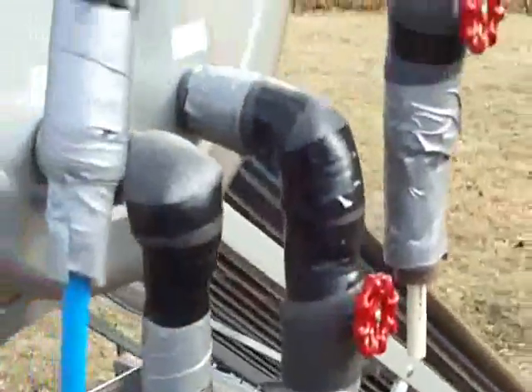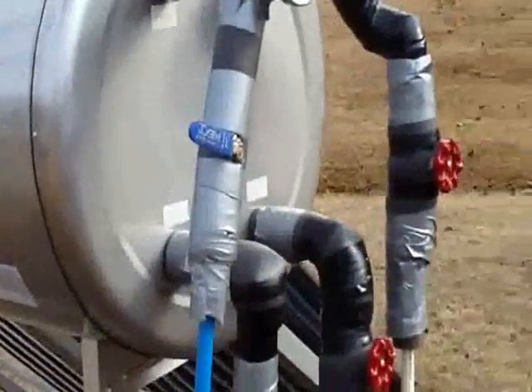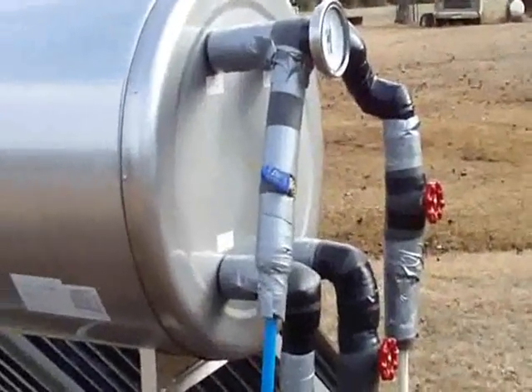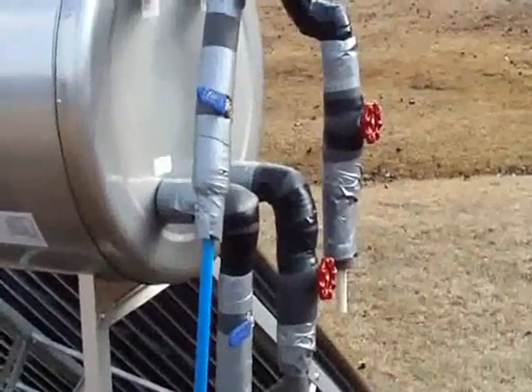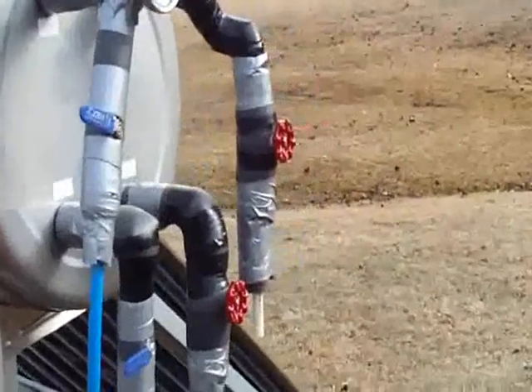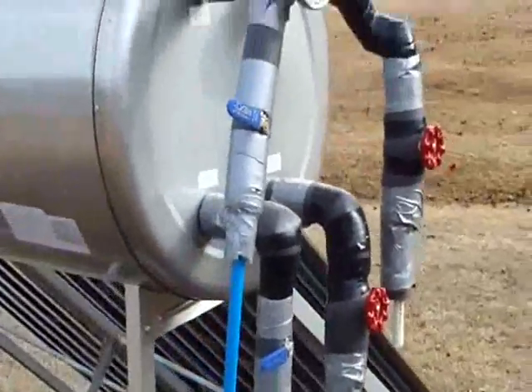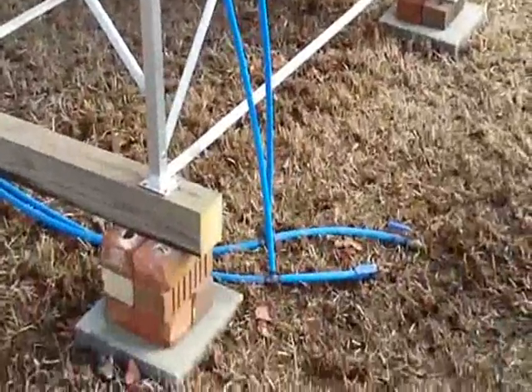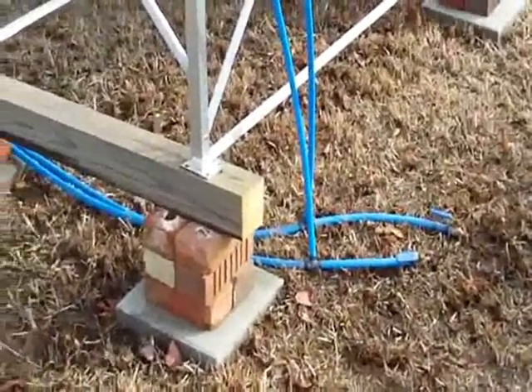There are 20 of these tubes and about 55 gallons of water contained inside this tank. This is a high-pressure system, which means it is capable of withstanding the pressure of a standard household water system. I've got a deep well installed on the property operating at around 50 to 55 psi. This is a little bit of a Rube Goldberg plumbing proposition, because I need to be able to drain the system since it does freeze in this part of the world.